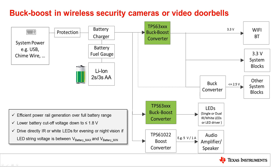In a similar manner, the buck boost converter can control high power LEDs. A typical IR LED needs 1.8V forward voltage. A 2S configuration with 3.6V forward voltage drop ends up in the middle of the lithium-ion battery voltage range. A buck boost converter can work as a highly efficient LED driver that works independently of the battery voltage being higher or lower than the LED forward voltage.